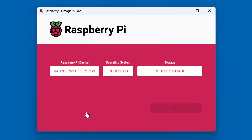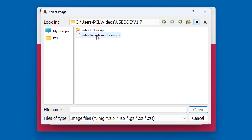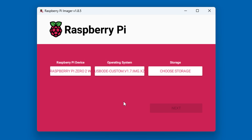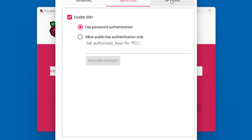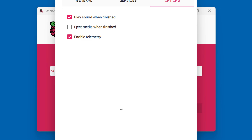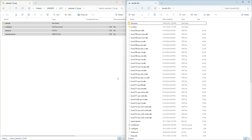But to my surprise, this works much better than I expected. The initial setup is very easy. We use Pi Imager to write a supplied image onto an SD card. Make sure you get a fast SD card because it can affect startup and loading times. You need to press Ctrl, Shift, and X to access the advanced options where you can configure your network settings. Remember that this Raspberry Pi only supports the 2.4 GHz Wi-Fi network.